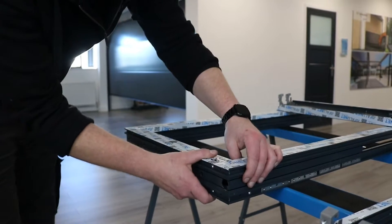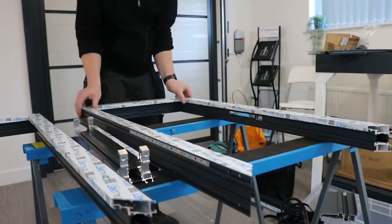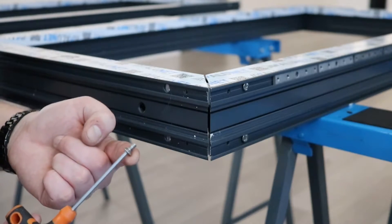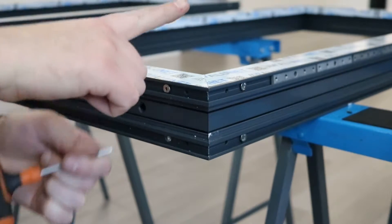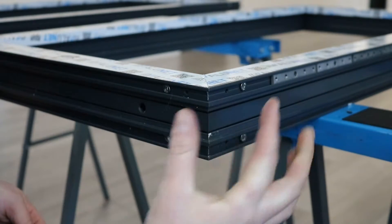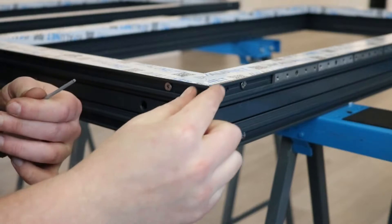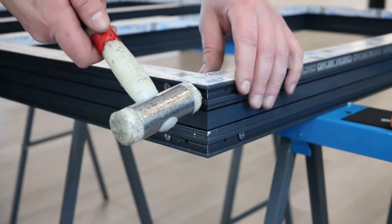Repeat with all sashes. Now we need to screw the corners together — put the screws in the holes. These screws pull this bar that way and these screws pull this bar that way, so we need to equal this corner up. If after adjustment you still have a little step, this can be tapped lightly to line the corner up.